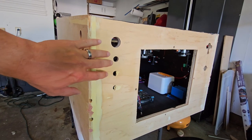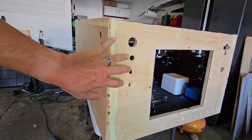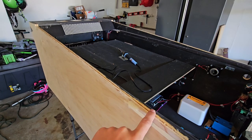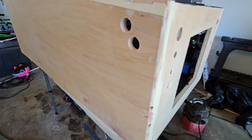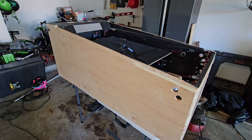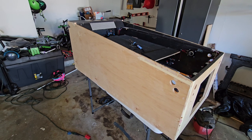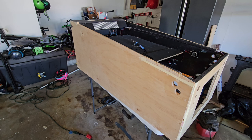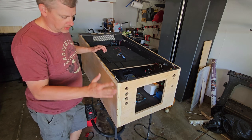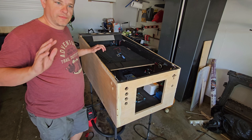I had three buttons on the front that were really tiny, and I think I'm going to expand these out to be full-size buttons because I've come up with other ideas for the two middle buttons. I recut the channels — I cut a channel on the bottom front and on the bottom on the other side to lock in the artwork. Most pinball companies don't actually put T-molding down there, but I wanted a nice edge to hold on to without hurting my hands or to make it easier sliding in and out of the car. I ended up drilling out those three holes, making them bigger for three larger buttons.